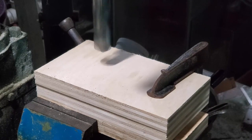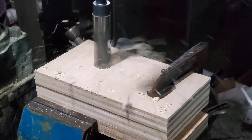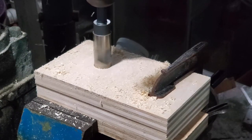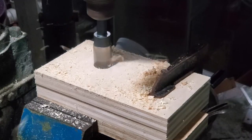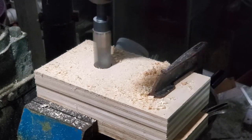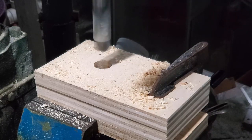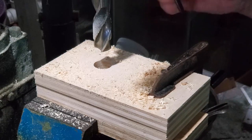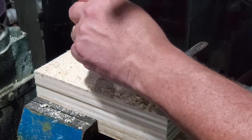Because you can't take a diamond core bit and run it through plywood with any kind of ease, I am using a drill bit here. This is just under an inch by a sixteenth — you see me use it for acrylic all the time. I drill the hole with this one and then put in the diamond bit, which will basically sand out the inside and make sure I have a really tight fit.